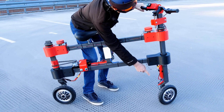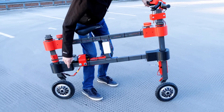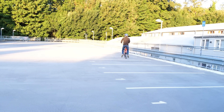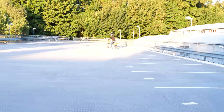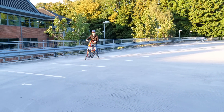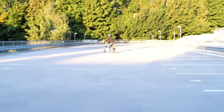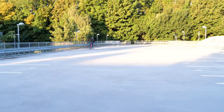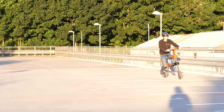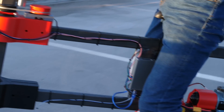The first test is our control for the experiment — riding the bike like a normal bike with the back wheel fixed in position and the front wheel steering as you'd expect, with both wheels still powered. As you'd expect I can ride that like a normal bike and I can turn and do all the things you'd expect. Having my feet near the ground makes it really easy to put them out if I fall. It rides like a normal bike — not particularly fast on a 6S LiPo when the motors are rated for 10S, but it seems okay, feels quite safe, and the braking strategy works quite well.